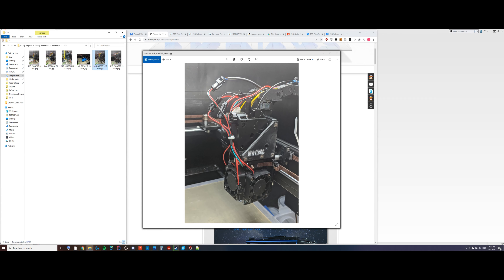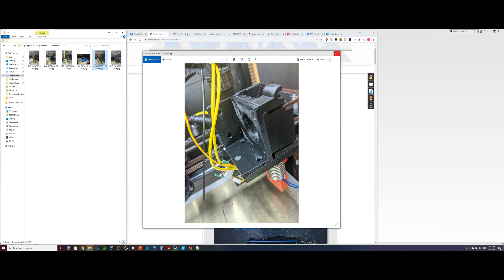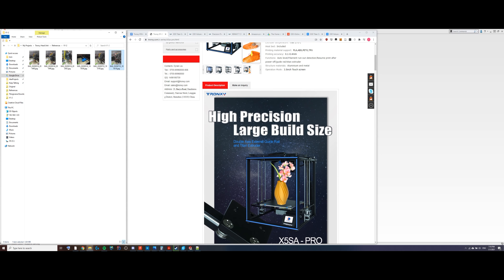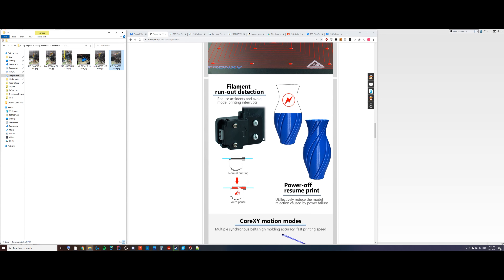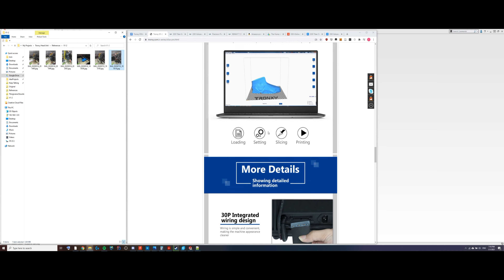This was my most recent version until I made a change that kind of inspired me to do this project. In this picture you can see I used a lot of threaded inserts — this made a huge difference in being able to assemble and disassemble it without wearing out the plastic and the way the screws thread into it. It also provided an opportunity to attach this brace for a little bit of extra rigidity. That's essentially what got me to this point. I'm a little embarrassed to show my SolidWorks model of that because I made some changes and it basically got messed up, and that made me realize I need to go back and redo the model with what I've learned about SolidWorks and how I can improve designing that model so it's more adjustable in the future.